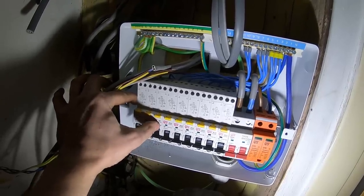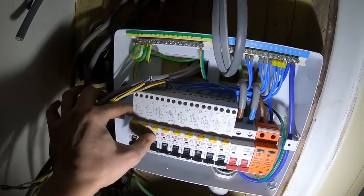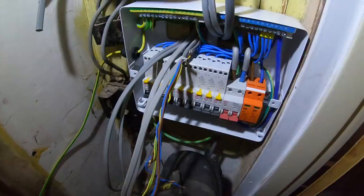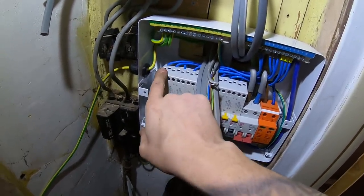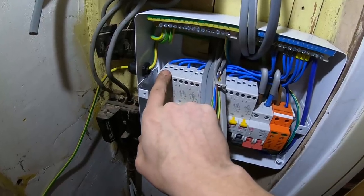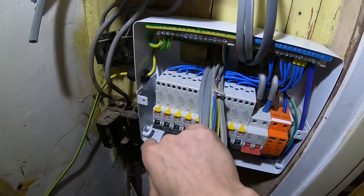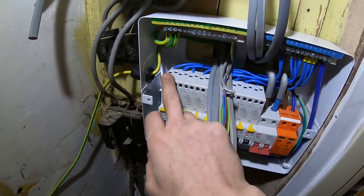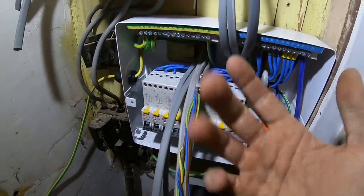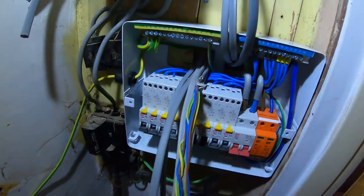I decided to put all the flyleads in for the neutrals and crimp them all, just so I can get a nice neat finish without having to mess around with everything later. I've got one 20-amp breaker, which will be for the boiler, and one for a loft socket — so it doesn't really matter as it's not going to be powered up anyway. For the lights — the smoke alarm is going to tap off the same lighting breaker. The reason for this is we've had it before where a smoke alarm is beeping because it's out of battery, and they just turn the breaker off. If you put the smoke alarm on the lighting circuit, it means if there is an issue they'll come and get it repaired rather than just flicking it off. That's my rule of thumb now. The crimping set I'm using was off Amazon — about 20 quid, I'll put a link below, it's a great little piece of kit.